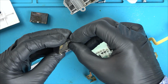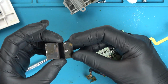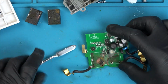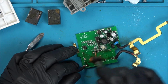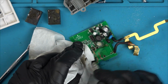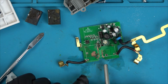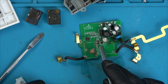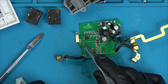Okay, so I presume these little ones are the low voltage and the big ones are for the mains voltage. So when power is applied here, these will join together. Now what's happening here? Let's clean it up and hopefully it might make more sense. So these are connected out to the actual plug. Yep. So when power is applied between here and here, then this one here is going to join to here and put, for example, the neutral through. And on this side, when this one is joined to here, it will put power through from here to here.